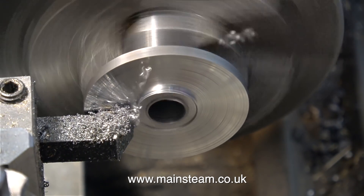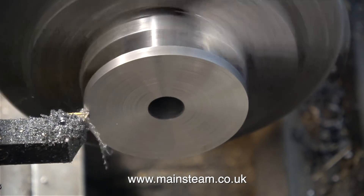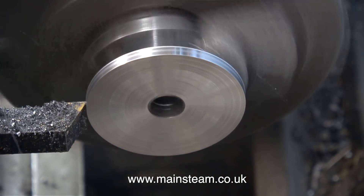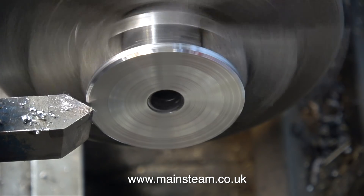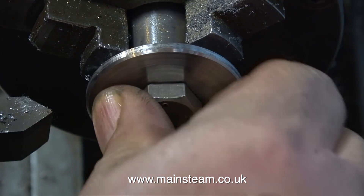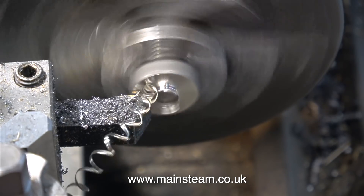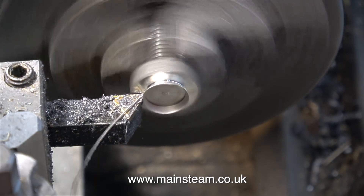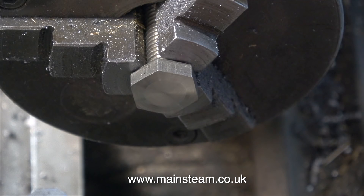You've just been watching me parting off the component from the original piece of steel, so now I've turned it round in the chuck, I'm facing the other side of it, followed by machining the outer diameter to the right size. It's going to be a little bit bigger than the original, because it can be — it doesn't need to be an exact size. I'm taking the sharp edge off with a V-tool, and that's the part more or less finished. The 10mm bolt fits fine down the centre, but it looks horrible — I don't like the writing on it, and I think the bolt head is a bit too deep. This is a stainless steel bolt, but it's cutting very well, and as you can see I'm turning down the head of the bolt to get rid of the writing and make it look a lot more model engineering-like.